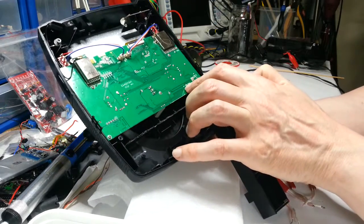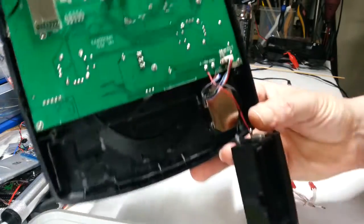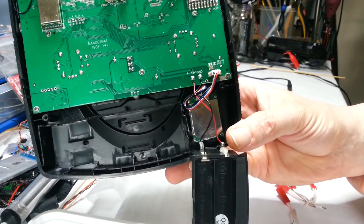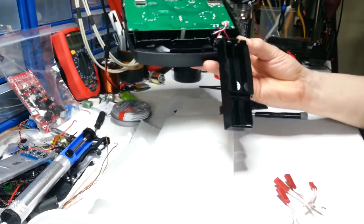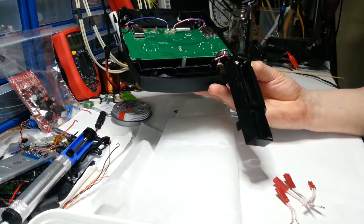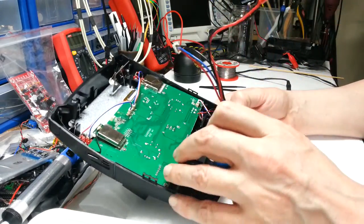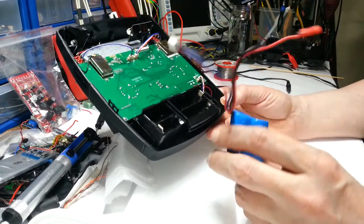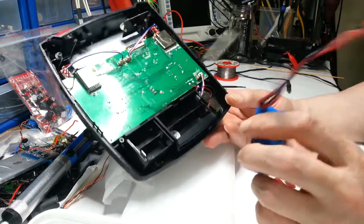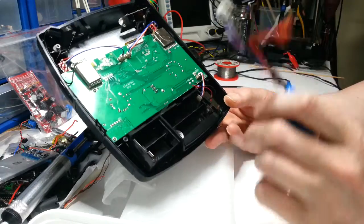This is great because it says 4 volt to 13 volt that you can put into this. I don't know if you can see that, I hope you can. 4 volt to 13 volt. So these being round about 8.4 volts, because they're fully charged, is within that acceptable range. And I can just parallel them up. I have seen somebody else do something like this and they put a buck converter in and all sorts to keep that 6 volts.